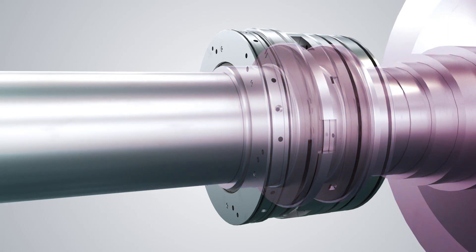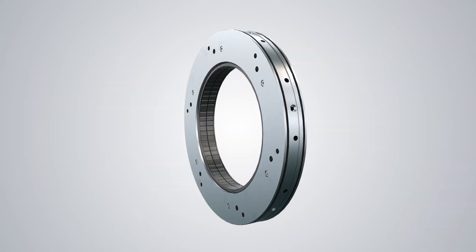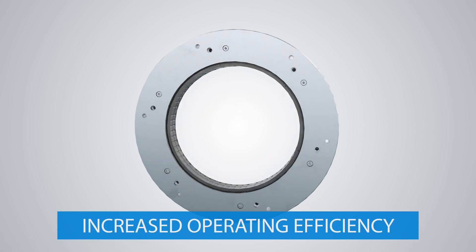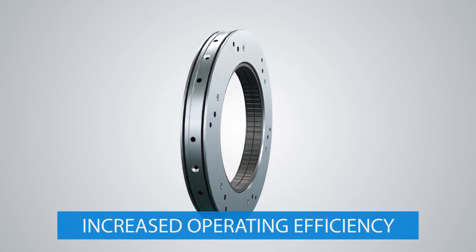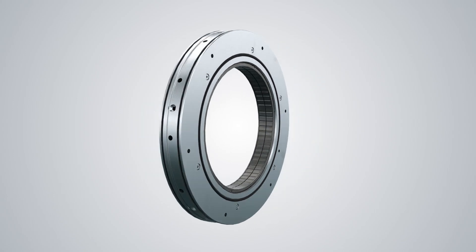The Type 93 LR is developed to maintain a consistent clearance in both cold and hot operating conditions once pressure is applied. This mitigates variance in cold and hot separation gas flow. Developed to reduce separation seal gas consumption, the new Type 93 LR offers low consumption in both pressure differential and flow control system designs.